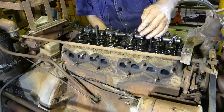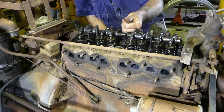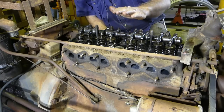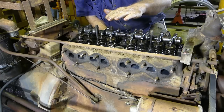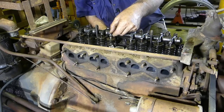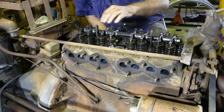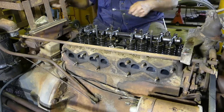Normally through normal wear and tear, as the valve sits in the seat it sort of mushrooms and gets lower into the seat, which means it comes higher and higher through the head — so you often lose a little bit of valve clearance, a valve can ride high. In this instance it's way the other way.